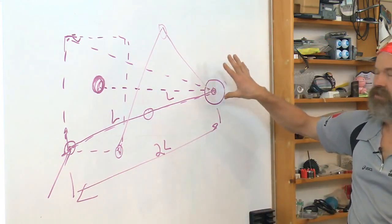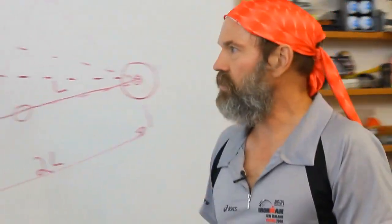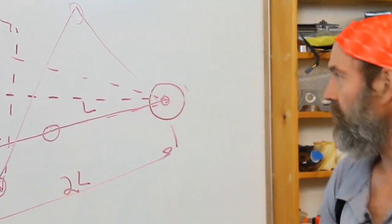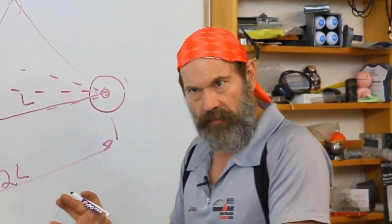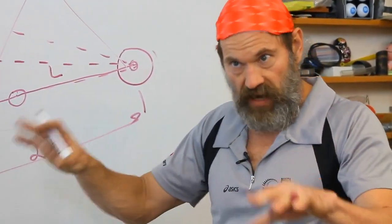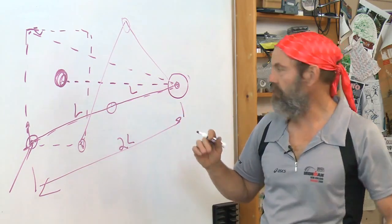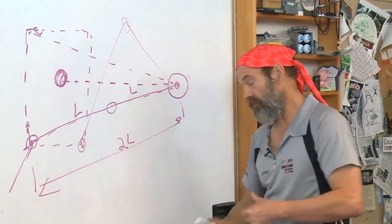When you're sketching things, that's the next step. Now I just had a simple stick figure for the motions. Now I start sketching and putting some meat onto things to get an idea of some detail and design intent. In topic three, we're going to learn about Saint-Venant's principle, which says that if I want to control something, I grab it by two to three characteristic dimensions minimum, but three to five is really good. If I don't want something to control me, I stay away three to five characteristic dimensions.